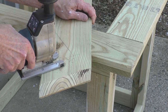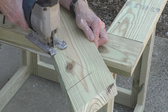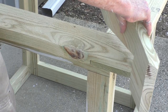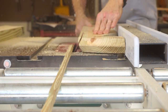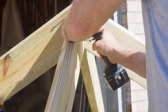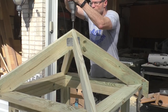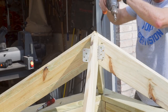This piece is running at a 30 degree angle but I want it to sit properly on the cap plate, so I'm using my jigsaw to cut a section out. Now I'm cutting a 30 degree bevel on each side of the rafters so the plywood will sit properly on the rafter. Normally I would just screw the rafters together where they meet, but because there's a weather vane running through the top of the roof and in through the rafters, I'm going to use a metal bracket to secure them — that way no screws will interfere with the hole I'm about to drill.